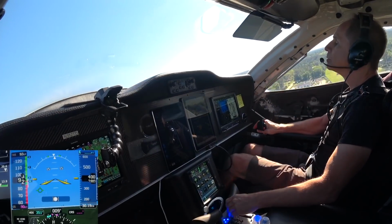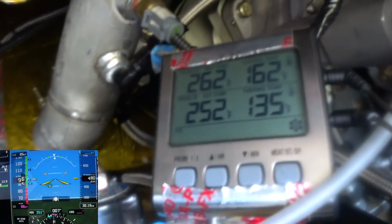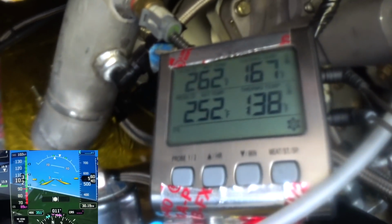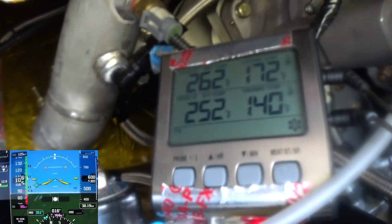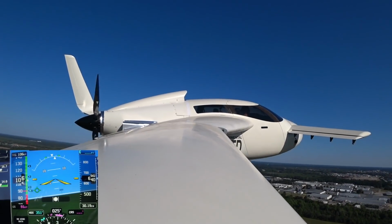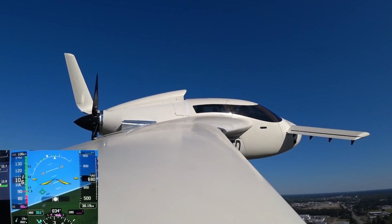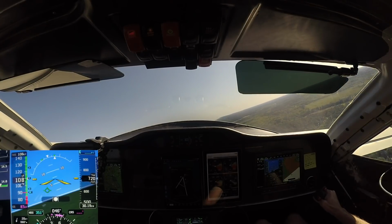And so my goal this time was to just go full power here for the initial takeoff and then back off the power to like 75% and try to prevent the engine from heat soaking. Those temperatures there, the ones on the right-hand side, were basically air temperatures inside the cowling. I was monitoring how much heat there was by the Y pipes and also how much heat was going out the back via the spinner there.